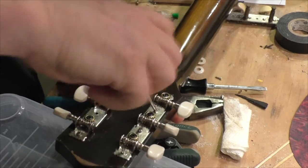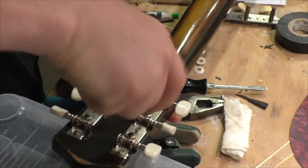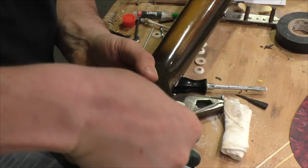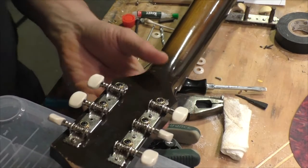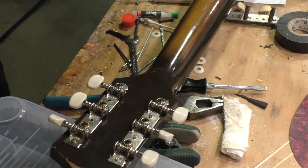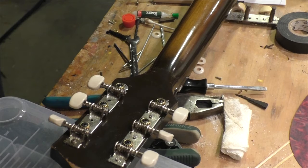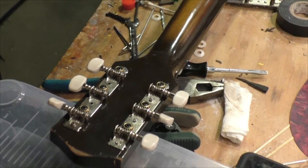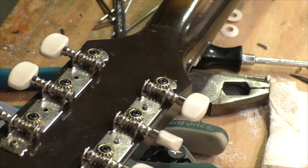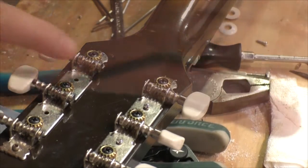And you just screw them in like this. Get that screw nice and tight. You don't want it too tight either, because you don't want to split the wood. But it's nice. So these two I'm going to have to drill. So I'm going to pause. I'm going to grab a drill bit, and then let's see if I can come back. We'll get a nice tight shot of how I drill these two holes.